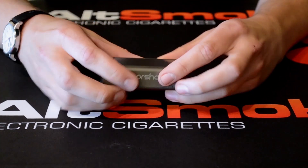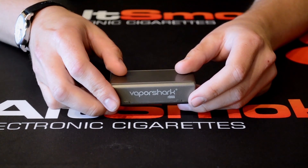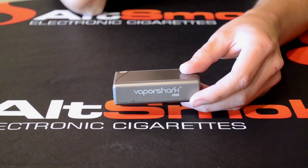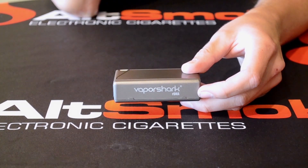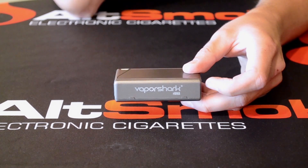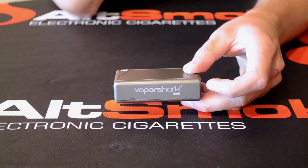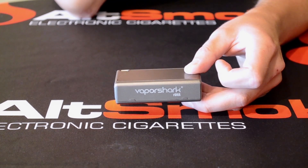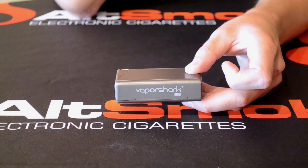Overall this device is a very easy to use all day vape and it's extremely reliable as well. You don't have to worry about using a resistance on your atomizer that might not be safe, because the chip is going to cut off anything below a 0.5 ohm resistance, so you never have to worry about a battery venting. You really don't have to worry about cleaning this mod out too much — it's a very easy to use and safe mod. And being that it's a charger as well, you don't have to get anything extra other than an atomizer.